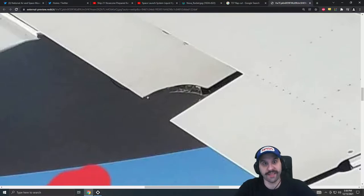There's a part of the wing that they cut off, or the flap, that's part of the Fowler flap that they cut. They cut it because it fractured. The aluminum started to get micro-stress cracks in it from being under load because it's the flap. It's deflecting a lot of air. So aluminum is tough to repair, okay? It's difficult to repair, so you know what they do? They just cut it off.